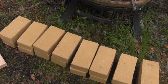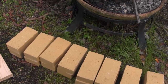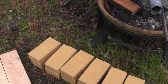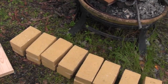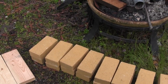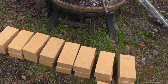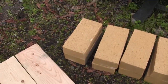The new foundry is made out of fire brick, which is a very good insulator — it won't crack up to 3,600 degrees Fahrenheit. That's way more than we need to melt aluminum, which is the only metal I'm going to be melting with this. I have 17 fire bricks in total. They're quite expensive — this cost me about 60 US dollars — but hopefully it'll be worth it. I came up with the design yesterday.